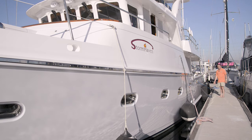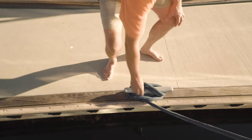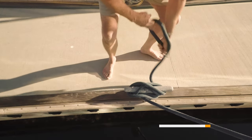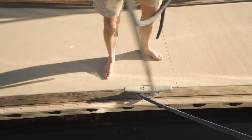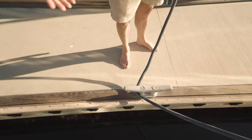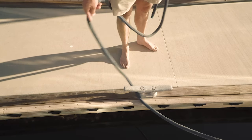Here's an example of a cleat that's tied up — and this is not what I would call a properly tied cleat. First of all, it's wrapped around and around and around. If I want to undo it, first I've got to find the end, then figure out how it's wrapped. In this case the thing was never even locked down, so even though it looked really tied up, there was nothing to hold it. If the boat was rocking back and forth in a surge, it would very easily have come loose and you'd be adrift in the middle of the night.